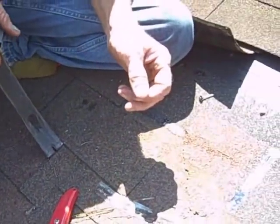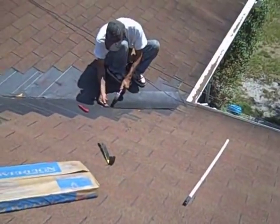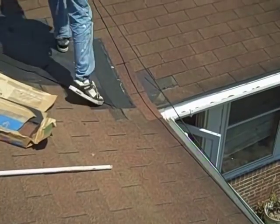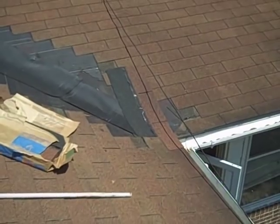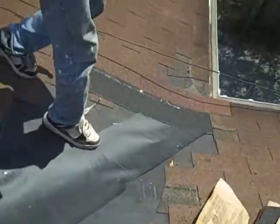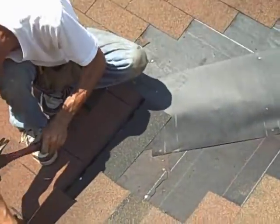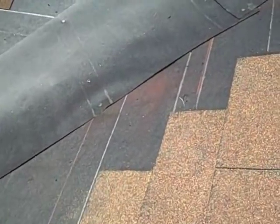Thanks for watching and I hope this doesn't happen to you on your roof. We're putting back these two valleys — except we're going to put them back right. They had a mess here, we're not going to let that happen. All of ours will overlap each other. You'll have a new darker shingle, but it's only because these shingles are eight years old — they were probably the same color eight years ago. The proper way is to run across — every shingle has to cross the other shingle.